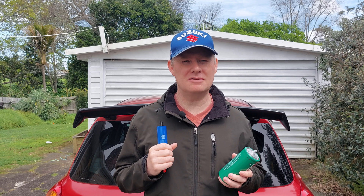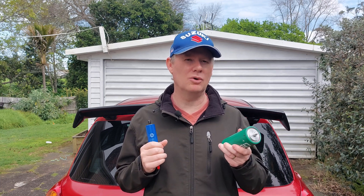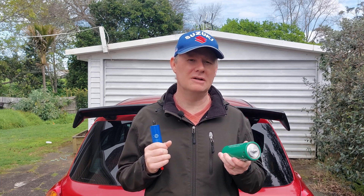The manufacturer's specifications say the internal resistance is 0.4, and these are much higher than that. Brand new ones like Alex bought — he tested them — AC resistance was 0.2 for brand new ones. We'll cut away to my scene of me testing the internal resistances. The internal resistances you're about to see are with the cells fully charged. They dropped back a little bit, and they actually do test different internal resistance when fully charged versus when flat, so their internal resistances look a little bit more equal.